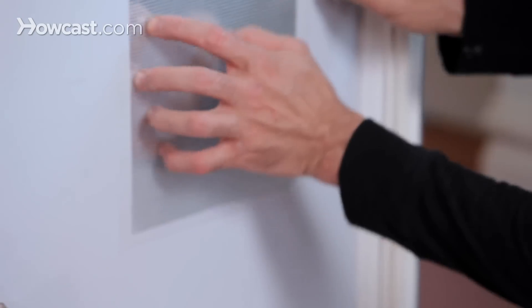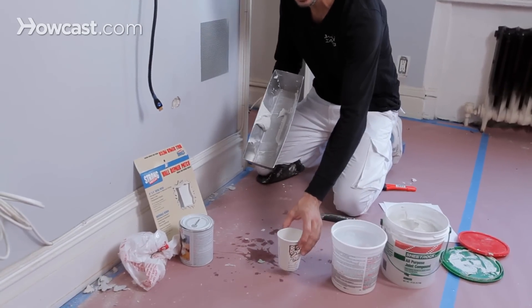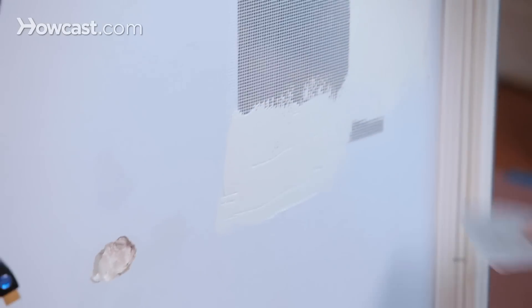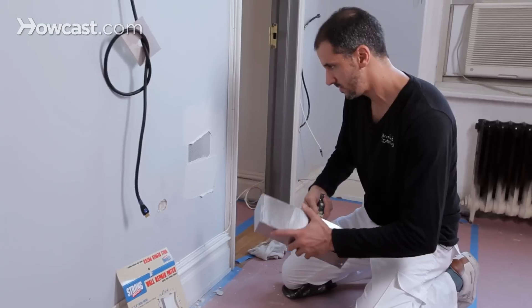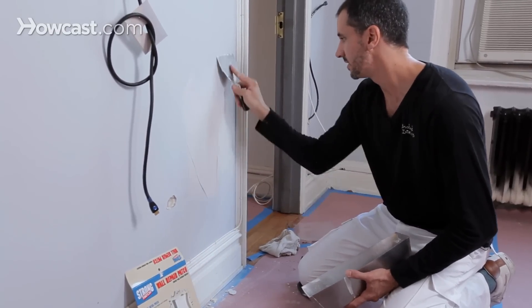You simply fill it in with your plaster compound mix. Here we have joint compound, plaster of Paris, and a little bit of water — mix these together about 50/50 and go ahead and fill it in. It'll probably take two coats, but we'll put our first coat on and go right over the middle as well. The second coat can be simple joint compound, which will give a smoother finish.